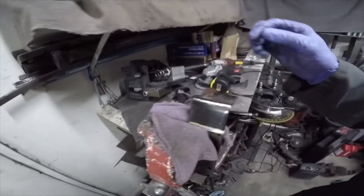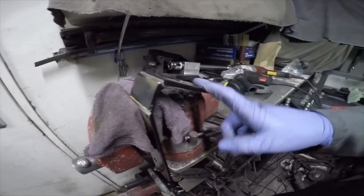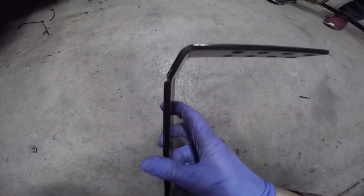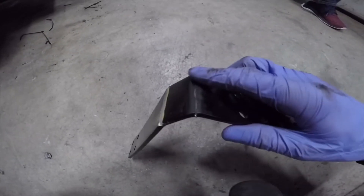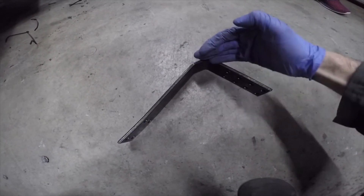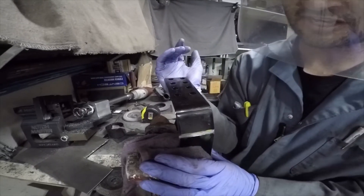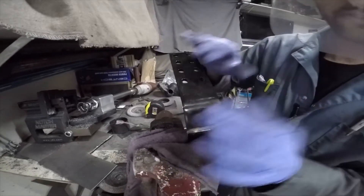There's another slot right here so we're going to bend this up while it's still hot — not by hand, but with a hammer. It still makes a 90-degree bend but it's split across two bends. We need more angle, so we cut a little bit more out to allow it to open further. The reason we keep cutting is to remove metal and allow this to collapse and be pushed up. Once we find the right angle, we'll clean it up and weld it solid as one piece again.